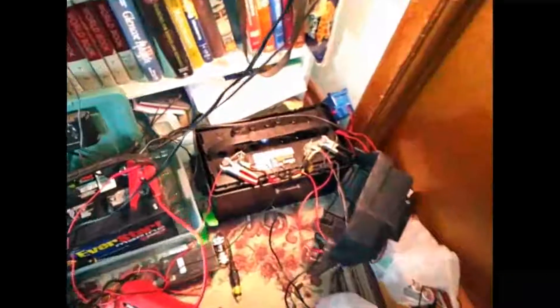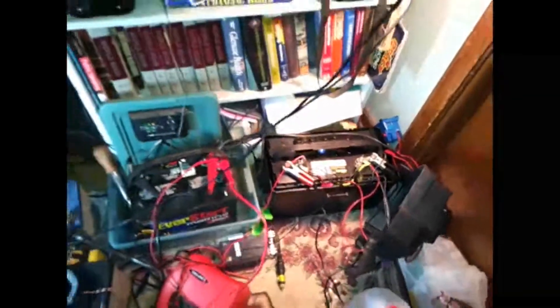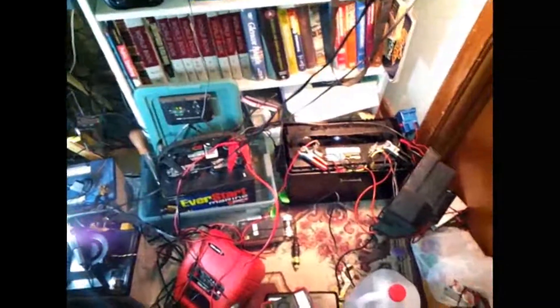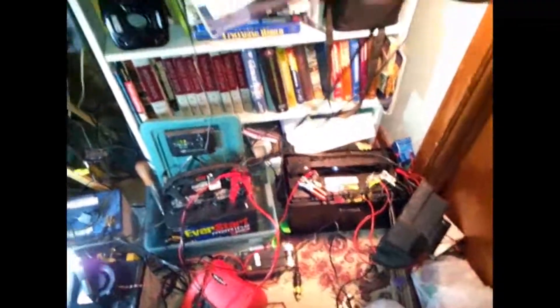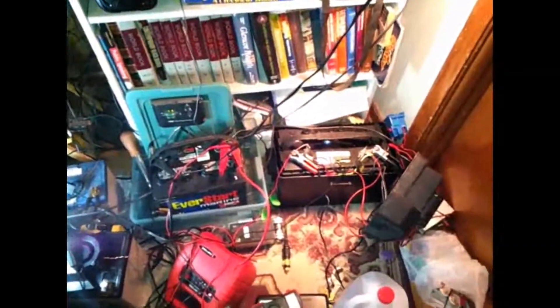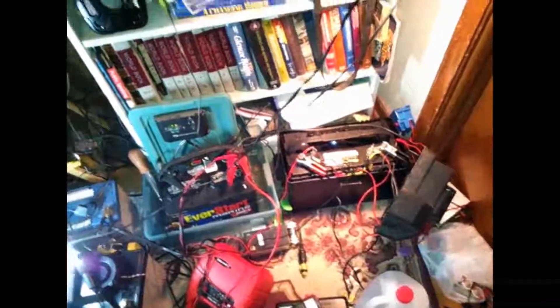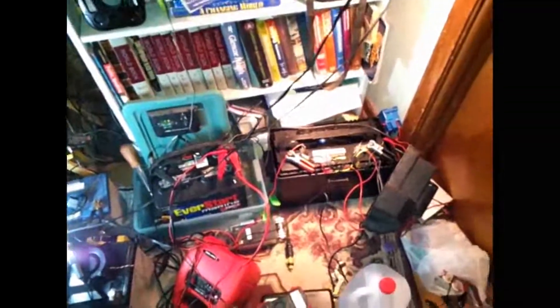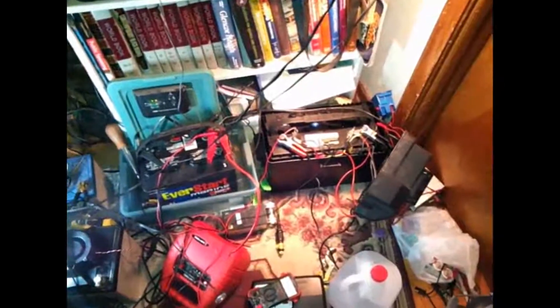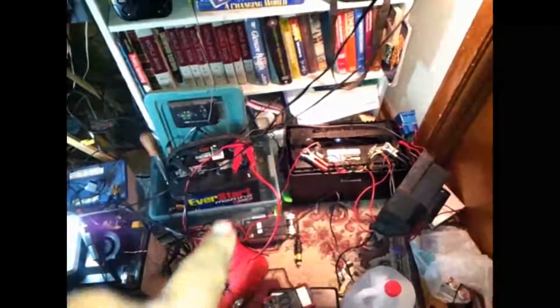I have bought those panels. I'm not expecting my battery to fail. This is really disappointing because I am a battery nut. I maintain my batteries like crazy. I desulfate them. I equalize the batteries every three months or as needed. I also make sure my electrolyte levels are normal. I try not to deep cycle them, bring them lower than the 12 volt range. They have very few cycles on them — maybe about 20 or 30 cycles per battery.